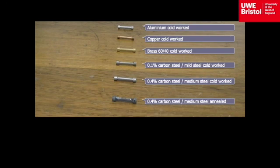This test procedure is to determine some physical properties and characteristics of a range of different metals. The procedure will be run according to British standards equivalent to international ISO standards, and each specimen will be tested at the same rate of extension, that being at 3 mm per minute.